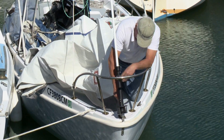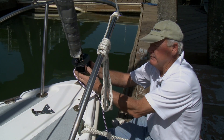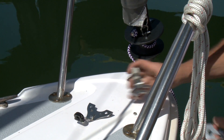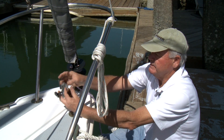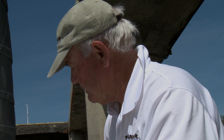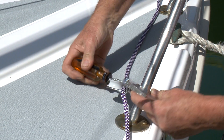Now we feed the sail end of the stainless steel feeder, bring it up to the swivel, shackle it on, and raise the sail. One of our final steps is to figure out where the control line is going to lead to the cockpit. We put a small bracket with a bullseye onto the cage — it clips onto the cage using the same hole spacing as the drum fasteners. That gives us the perfect location: a bullseye at 90 degrees to the drum, about that spacing off the drum, and right in the middle, so the line spools up and down just the way we'd like. We run the retriever line through the bracket and bullseye, then down to a spring-loaded stanchion lead block, and then run it low to the deck to one more fair lead before it reaches the cockpit.